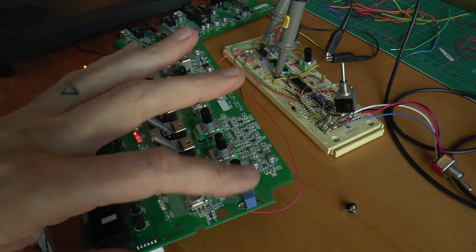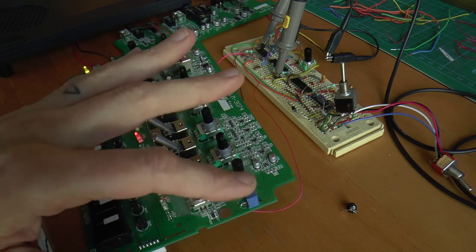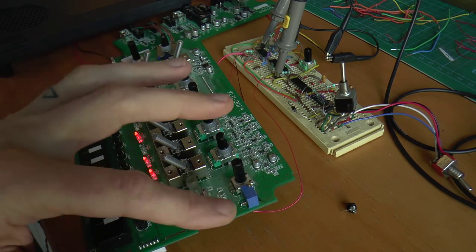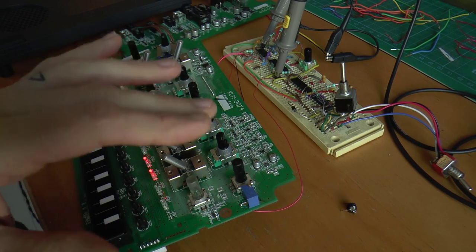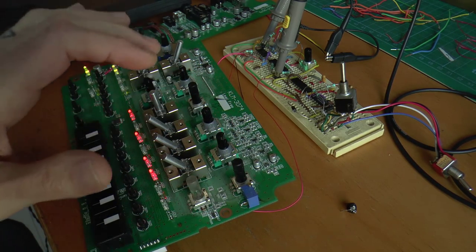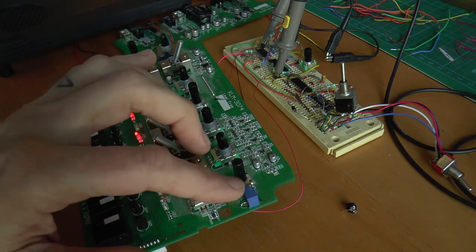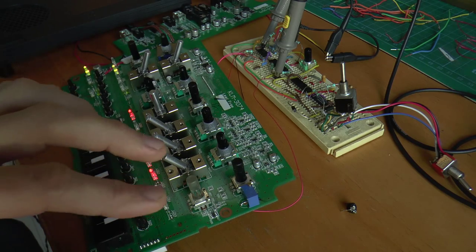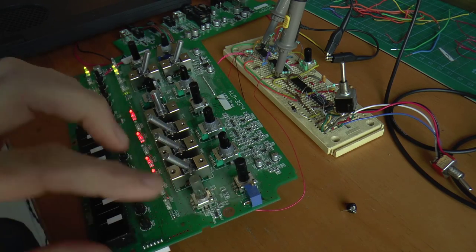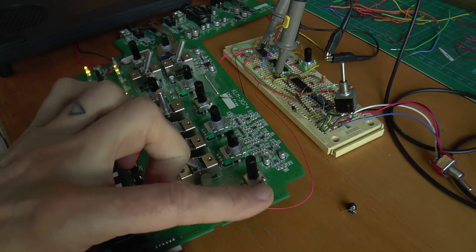In any case, this is what you attach, and then, as I mentioned before, you measure the voltage and adjust it precisely for a zero voltage on the other side of the differential amp, and then any popping or clicking you do have will be amplified as minimally as possible. So, again, this is a big help.